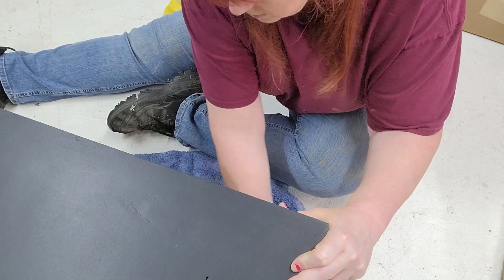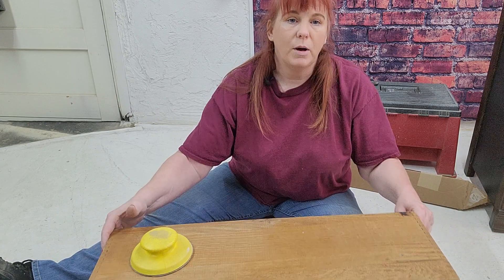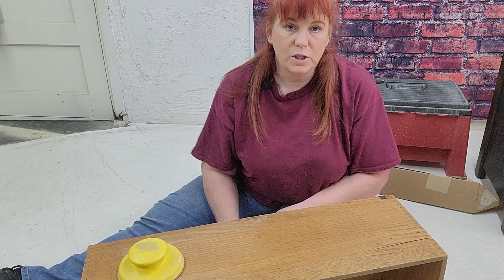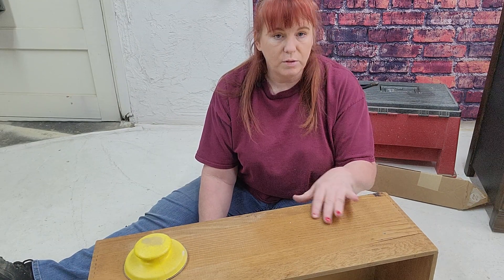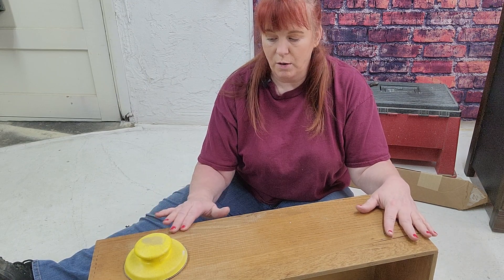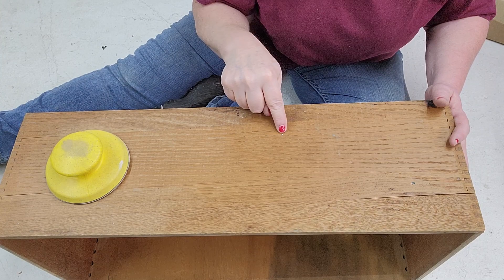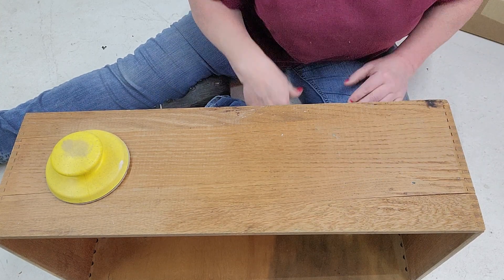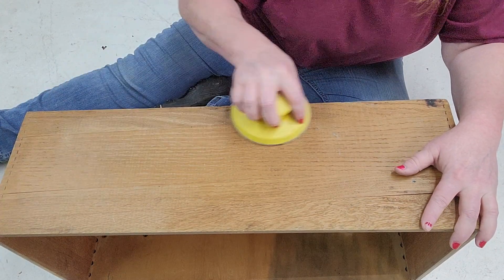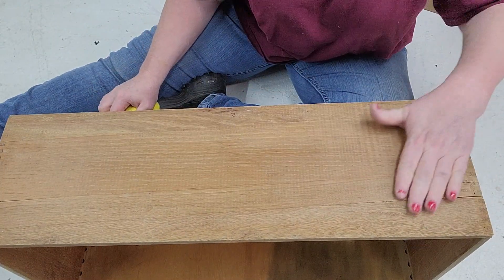The first thing I'm going to do is wipe it out again. I take all the drawers that I've painted and look them over. Although these were cleaned when we started this project, by the time you're done they've had time to get dusty — little things where you've set them on the floor or what have you. Just go through and check them over. Make sure the wood feels nice and smooth. If you have little bits of paint where the surface wasn't completely clean, just go through with sandpaper and make sure that's nice and smooth.